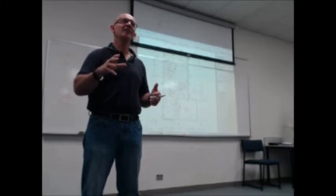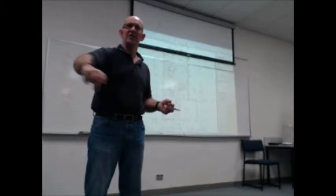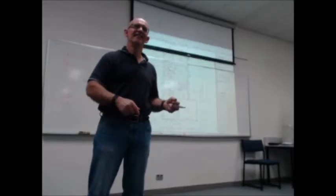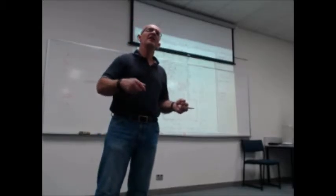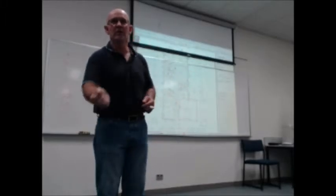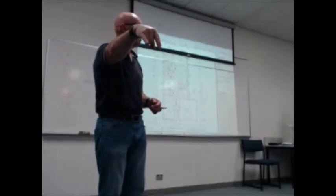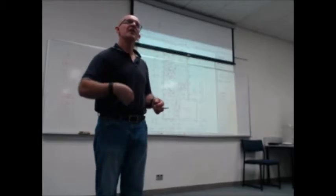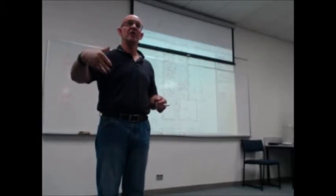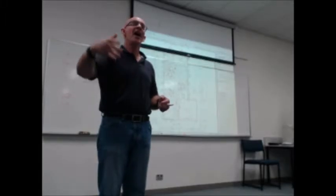When the tiler tiled the drain in the shower, the channel, he'd gone the wrong way with the glue, because the glue should always go with the way of the water, so anything that gets through follows these channels and gets through into the waste. And they also have weep holes to collect any moisture underneath. He blocked these weep holes as well, and they figured that was a problem, and it had leaked.